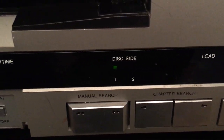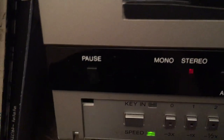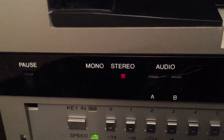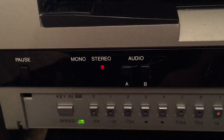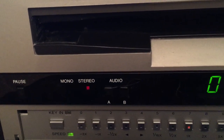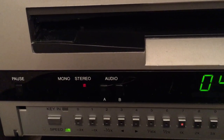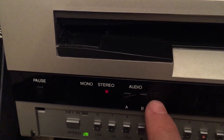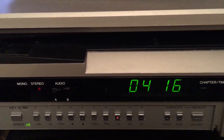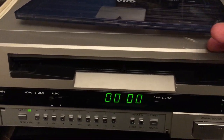Then we have our side indicator, which like CED is triggered by the plastic end piece on the caddy. There is a mono and stereo indicator; however the sound on this is always discrete two-track stereo. So if the mono indicator lights up, that just means the material was produced in mono but it's still playing two discrete soundtracks — unlike CED, which has a signal similar to the way it worked on FM and analog TV, where basically if there's no stereo signal you just get one channel. These are the audio A and B channels, which are flat on karaoke discs where it plays just either the left or the right channel, or you can use them both together in stereo.